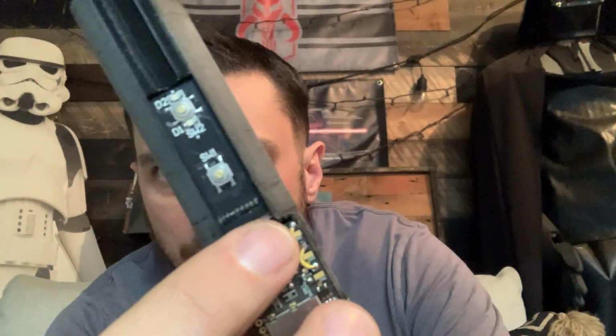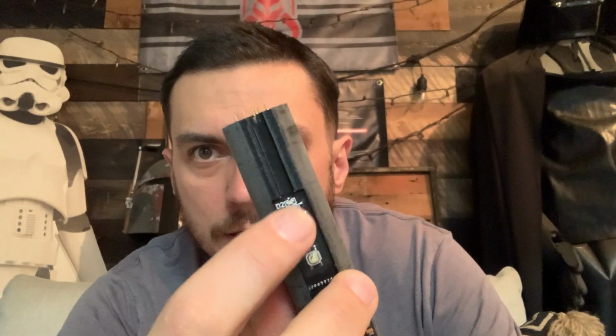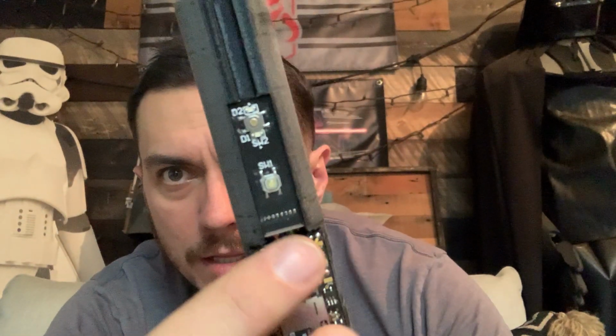We're going to start this video with the chassis outside of this hilt so that I can walk you through how to install it, because there are a few steps to it. When this hilt kit came, it came with its switch PCB already. It had all the wires coming out here that plug into the PCB that control the two LEDs right here, and then your activation button and your auxiliary button. All those wires were put right here with a quick disconnect. So I modeled my chassis to hold that PCB in place and then run that quick disconnect right underneath the board there. And it also came with its own pixel LED system. So I went ahead and modeled this chassis to hold that too.